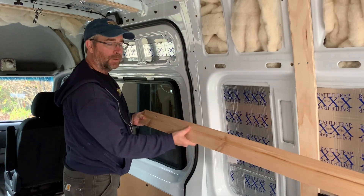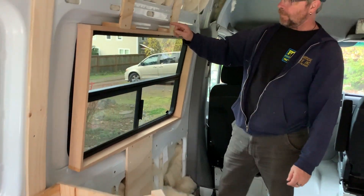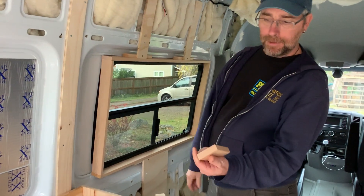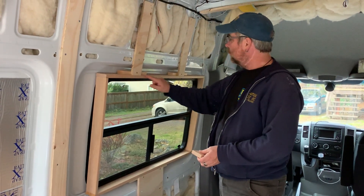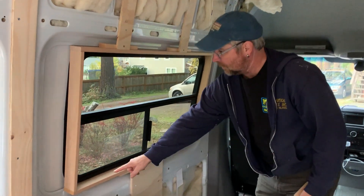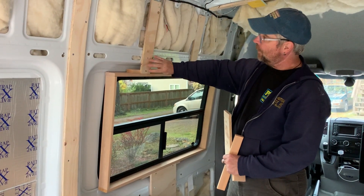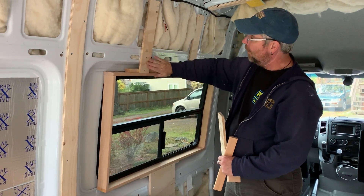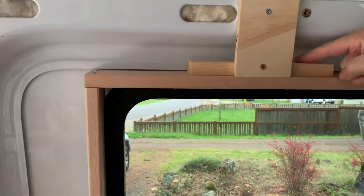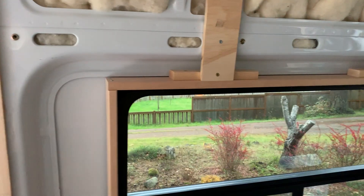We thought long and hard on that for quite a while, and finally this is what we came up with. We picked up some one by three hemlock — this is the only scrap I have left over — and we trimmed it so that this piece is about 44 inches, this piece is about 42 and a half inches, and then 23 or 24 inches — I'll measure these and put the dimensions in the description. We brought our furring strips down past this part of the van all the way down to meet up flush with the outside edge of the hemlock, and then we put some little strips behind there to run screws into, so this surface here is all going to be perfectly flush with the cedar.